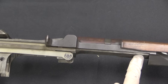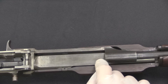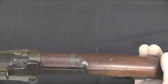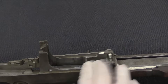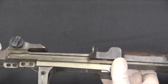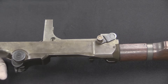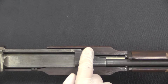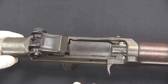Pretty dramatic change. The bottom of the barrel has been milled flat — that gives room for this straight op rod, and that cuts a significant amount of weight out of the gun. Presumably they found that didn't have a deleterious effect on the gun being able to withstand firing. By using a box magazine they've been able to get rid of all of the mechanism that Garand designed for the clip feeding and ejecting process — that's all gone. In fact the cutout for the clip release is also gone; there is no clip release on the gun. The upper handguard was widened to match the lower — this is a very thin piece over here, and you can see a little bit has cracked off, but it is a prototype rifle. The action, however, is still basic all M1 Garand.